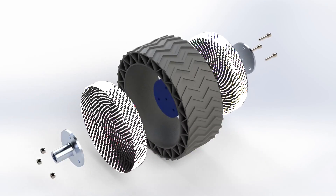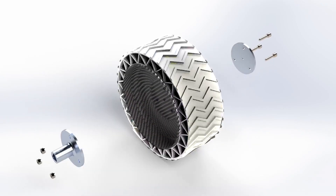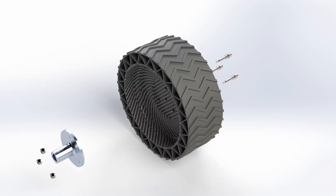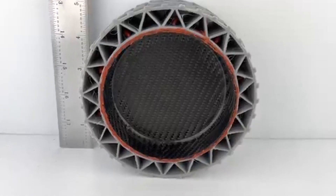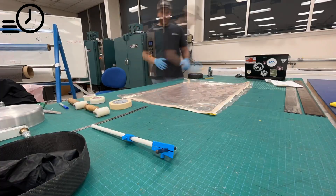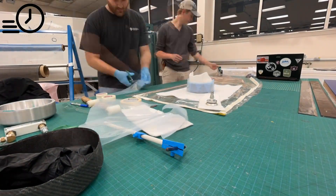The new wheel design consists of two carbon fiber discs bonded together at their centers to create a rim. A compliant tread sleeve printed from TPU bonds the discs to create the wheel. The wheels integrate to the rover using a wheel hub insert that attaches to the gearboxes. A subscale wheel has been built to prove out the fabrication processes, with no issues identified during the prototyping phase. We are in the process of manufacturing full-scale wheels that will be finished prior to competition.